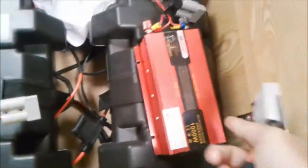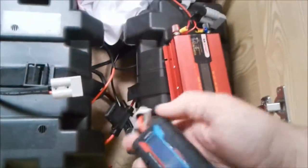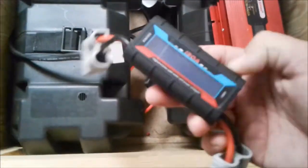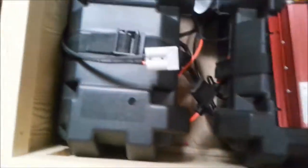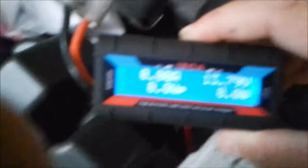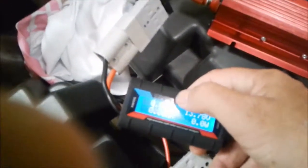Here I have a 1,000 watt inverter and a line which is connected onto my batteries by Anderson plugs. And here I just have a little meter so we can determine the amperage and current flow that's actually being used. You don't need this to do the job, but this is just for your information. So on, and here we have our readings including the most important one — amperage usage.